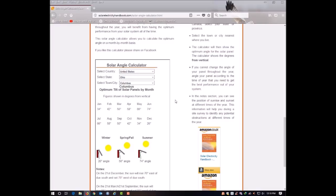I'm going to have one of my racks be changeable — I'll probably adjust it with the seasons. I don't think there's a need to change it monthly; that would get tedious. My larger rack is going to be a stationary mounted system. So I added up all the angles and divided by 12 for the optimal average. But since December was far outside the range of the other numbers, I opted to throw December out, add the other eleven months together, and divide by 11. When I did that I came up with an angle of 52 degrees.